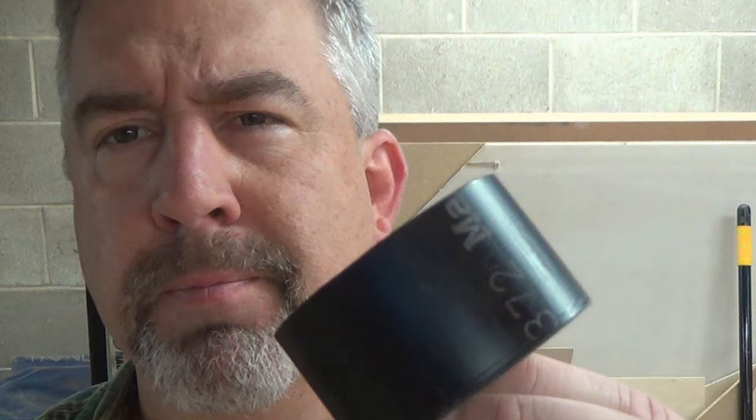So I did end up using 2-inch inner-dimension PVC pipe for this, and rather than just go with the standard black and clear coating, I said, let me try to get that texture technique on the pipe. It's ABS, black plastic pipe. I started to think about it, and I thought the best way would just be to use the belt sander. So that's what I did. I rested the tube on the ledge there, and I just rolled it by hand.